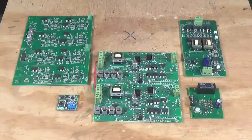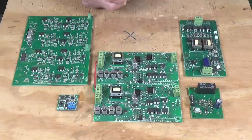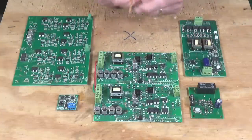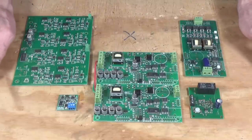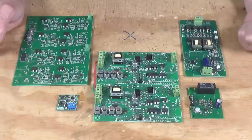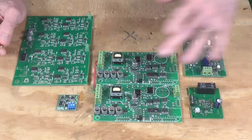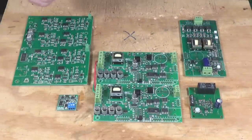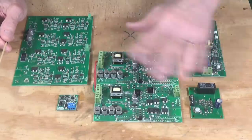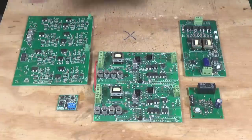So what are the problems? All of these devices, in order to work and protect your layout, command stations, boosters, and decoders, require a short circuit. I've warned you about the problems that can come with short circuits — even instantaneous ones — because when you have a short circuit, your booster is going to respond and start dumping power out, trying to maintain continuity. As a result, you can get voltage spikes and current surges coming out onto your track. Some problems that can occur include loss of control of your locomotive, and you can see runaways immediately — the train can just take off and won't stop until it rounds a curve and heads for the floor.